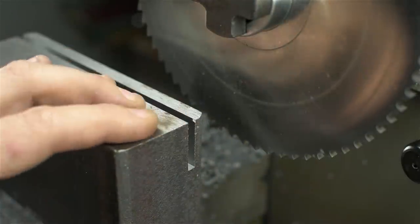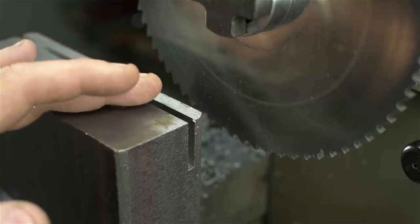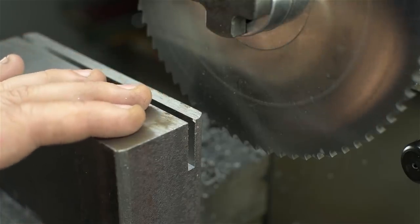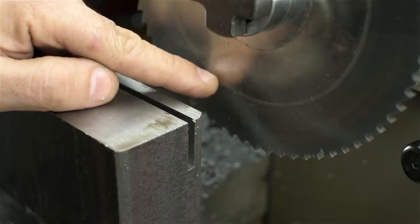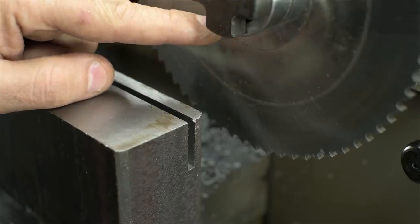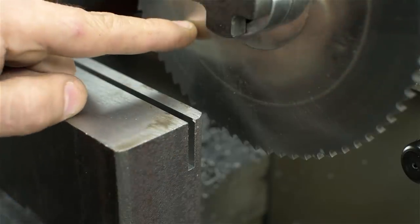I am very happy with that. The cutting rate was a little on the conservative side. A little respect for the spinning saw of death was probably in order. What you're looking at is only about half the capacity of the saw. It looks like it could cut twice that depth. I did this in two passes. Rule of thumb is 4 times saw thickness, I believe.